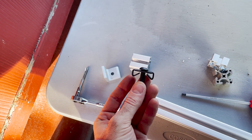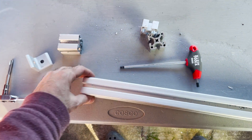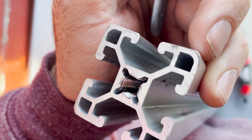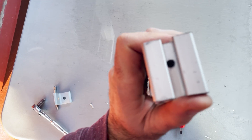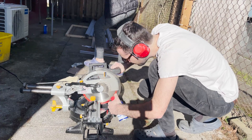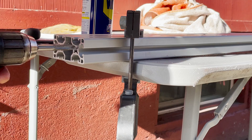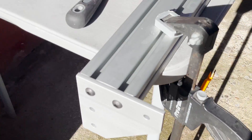I got these end fasteners that are supposed to attach through one piece of aluminum into the top of another piece, and you're supposed to tap the end hole, which I've done. You can see threads in there now, and then this piece slides in like that, and then from the top gets screwed in. Here's the last cut — just testing the fit.